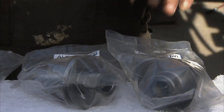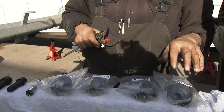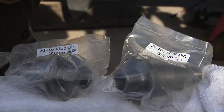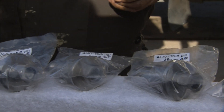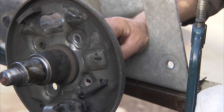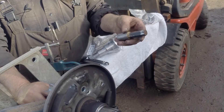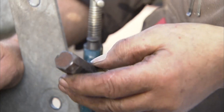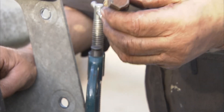There is another one — a big one with a huge nut on the back. They never seem to go wrong; we don't actually make them yet, but if the market was there we would make them as well. We make all these in-house on our CNC machine, made from very high tensile steel and ready to work. They are removed using an Allen key. This is one we made ourselves — an impact socket with a 17mm Allen key which we have cut down and brazed in. It is not very pretty but it does the job.